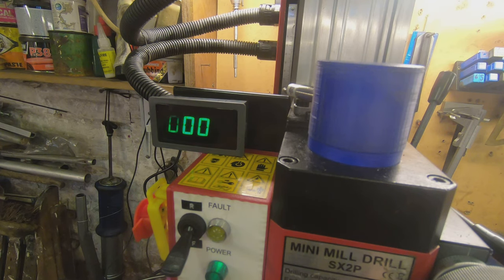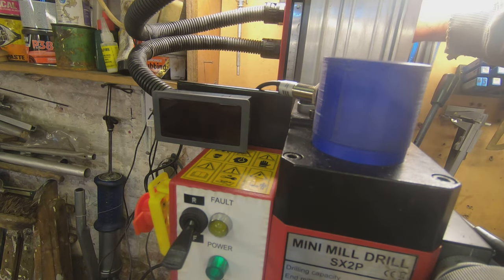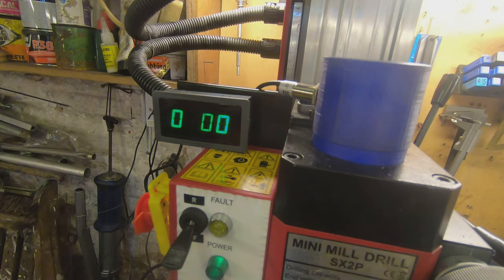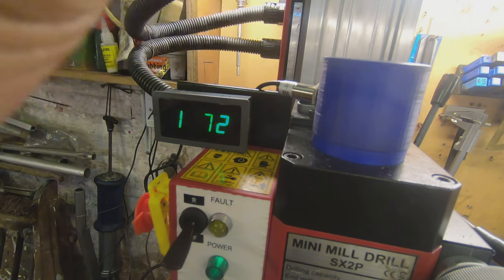Still nothing at all — okay. Now I think we've got there. Let me switch on the hall effect sensor — you can see it seems to be happily ticking away. Let's put some revolutions on the machine. It's not that steady — fluctuating between 70, 72, 74, 75, 73, 77, 75. However, at least it's working. I think I'll adjust the distance, push it in a bit closer to the magnet and see if that stabilizes it.